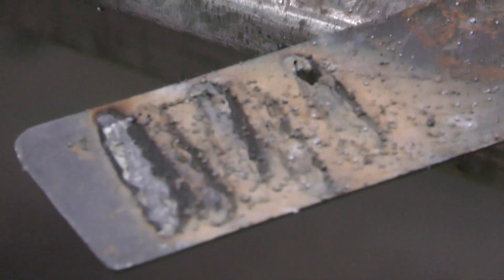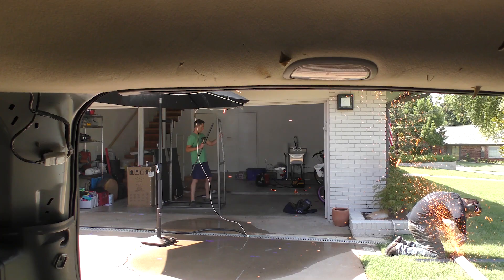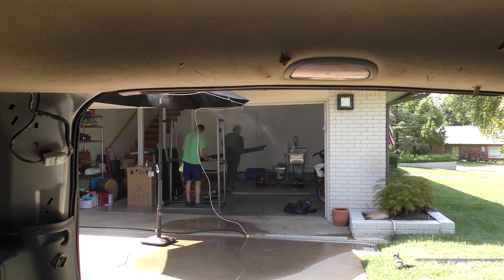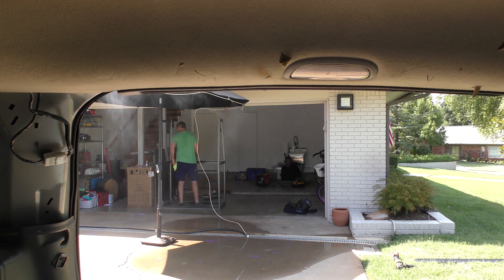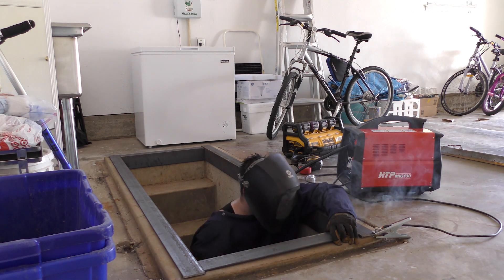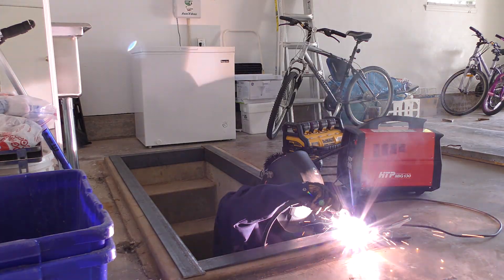It's nice if you're not asking a customer if you can hook up an extension cord to an outlet. You don't know if it's only a 15-amp outlet. The last thing I'd ever want to do is push a welder out at 30 amps down somebody's 14-gauge or even 16-gauge wiring in their wall and burn a house down.